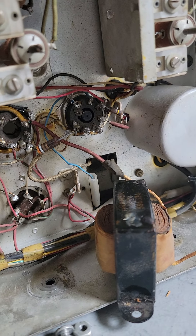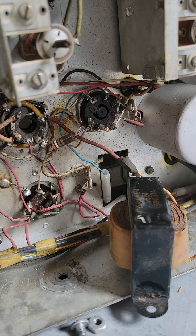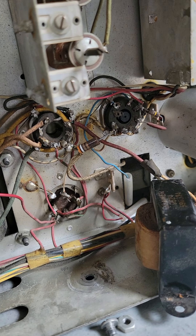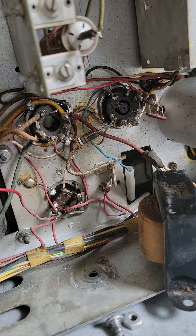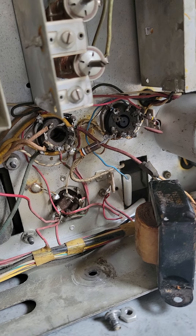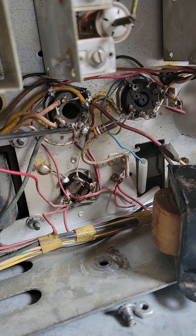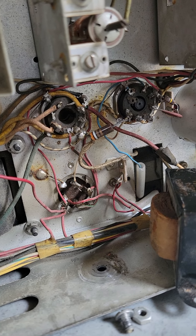I don't know what that means. I just want to say before I finish up here, that is something I need a little explanation on — because why are certain pins only shown on schematics as opposed to all the pins of all the tubes? I know that a schematic is showing all pertinent information of a circuit. So I don't understand, unless this is a mistake, how it doesn't show on the schematic that this 20 microfarad capacitor is linked to pin three of the rectifier, but yet it's linked to pin three of the rectifier here.